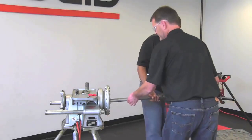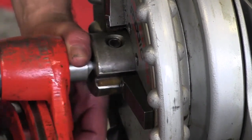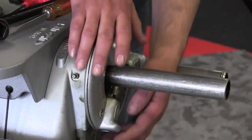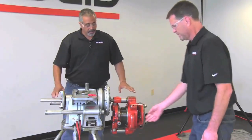Now as you're doing this, make sure that you align these grooves with the jaws. Insert that in place — it doesn't have to go in all the way. Chuck that up and tighten your centering device in the back.